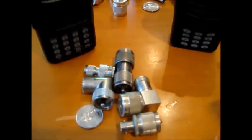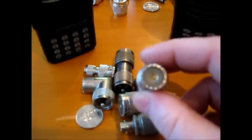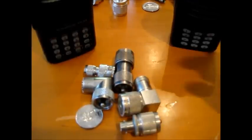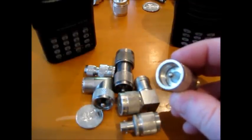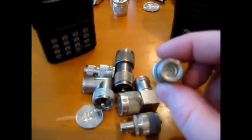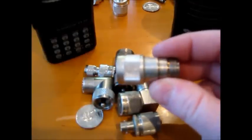You may have a piece of equipment with an N-type connector on the back but only have PL259 cabling. This N-type to SO239 adapter — you put that on the back of the radio and you can use your PL259 cable. The other way around, if you have equipment with an SO239 connector but only N-type cabling, this is a PL259 to N-type female adapter — put it on the back of the radio and use your N-type cabling.